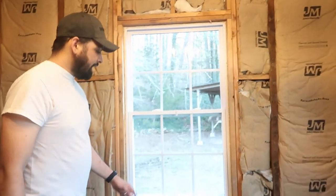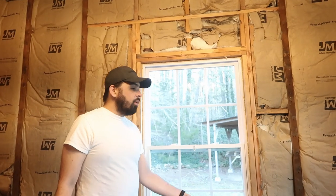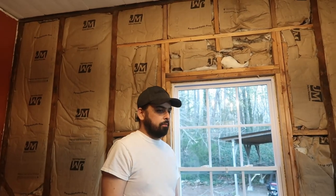In the end, these are the type of boxes that you use when you have to, because you're putting in a box in a wall that's already there, already covered, you don't have access to the stud, and you don't want to have to open the wall up. Then this becomes a really good option. So I'm not against using these, it's just that right now I have the opportunity to use something better.